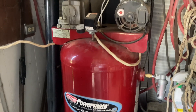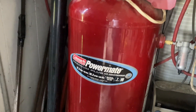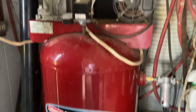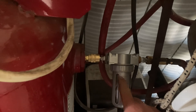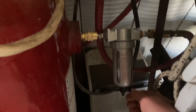Here's my compressor — I bought this probably 20 years ago. It's a Coleman PowerMate. It doesn't flow a huge amount of CFM, but it does the job for my shop. 60-gallon tank, so I like that extra capacity. And the other thing I put on was a water separator — it basically has a brass filter, very small micron kind of a net thing, that catches oil and water as it goes out.